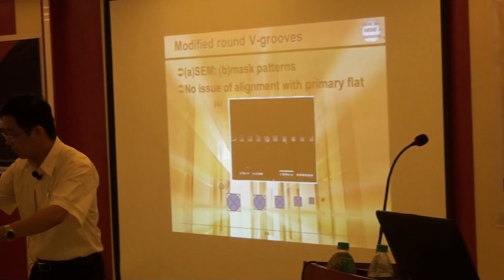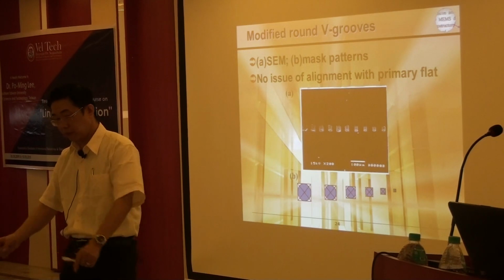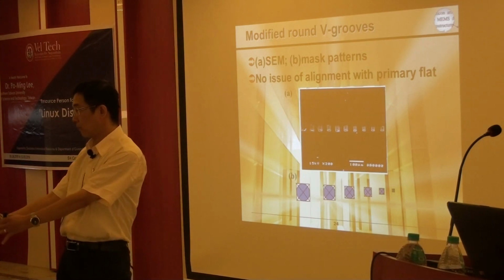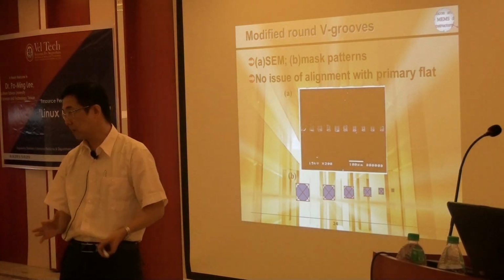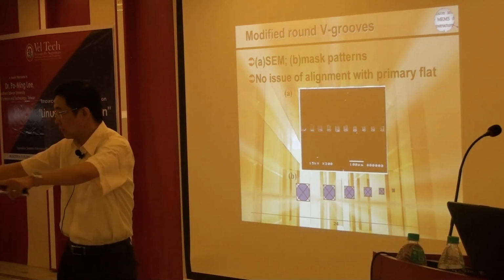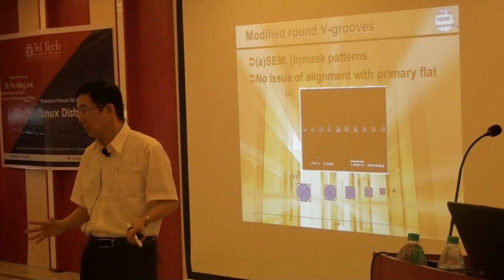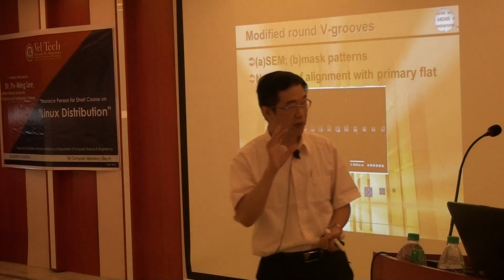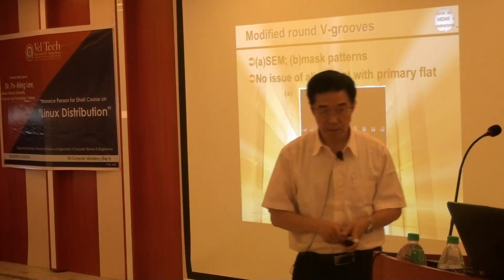My idea is, if we have a very good etching solution, we can use this kind of method to calculate where is a better place for the wafer, and what is the optimal uniformity of the chip. We can also try to modify the condition of the etching solution bath, so as to make the production design easy. So it's a very cheap way for us to identify the result of your fabrication.